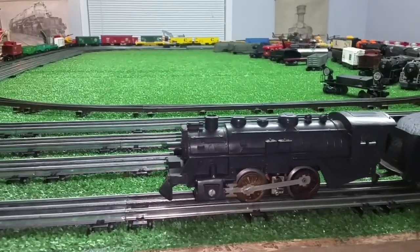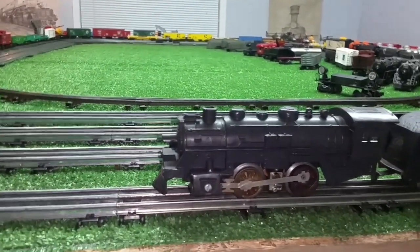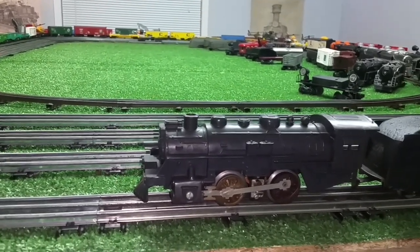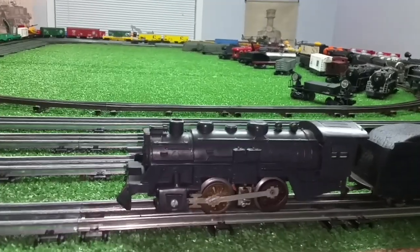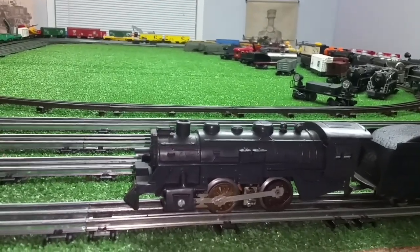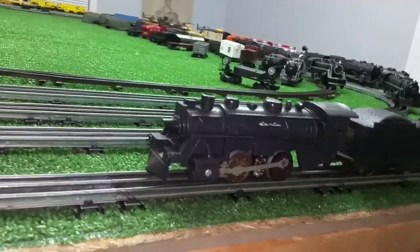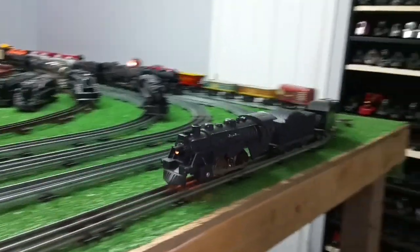And like I said, I tested the E unit. The E unit seemed okay. The brushes were okay. The springs were all right. The brush plate was okay. That only left the armature. Like I said, you'd apply power, it would turn half a turn and stop. Then you turn it by hand, it would turn half a turn and stop, and it always stopped in the same exact place, which meant one of the coils was dead on the armature itself. So anyway, put a new armature in it, and this is the result.